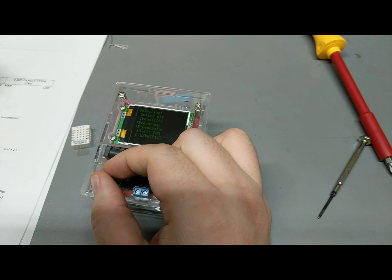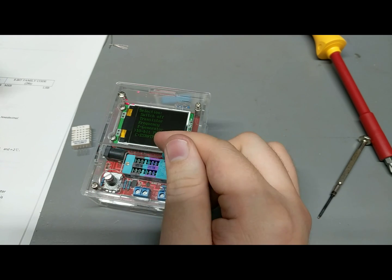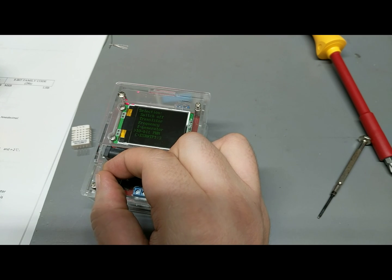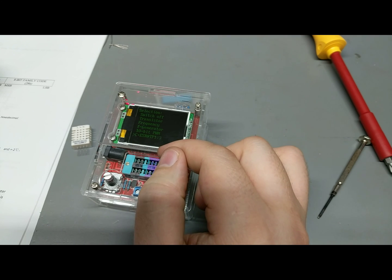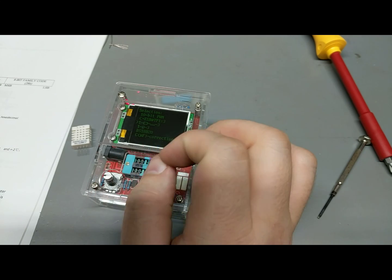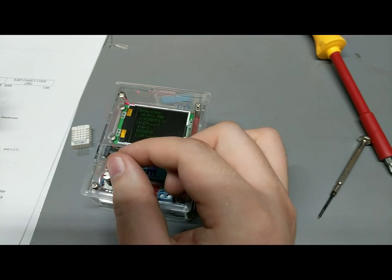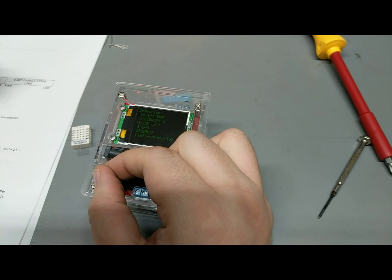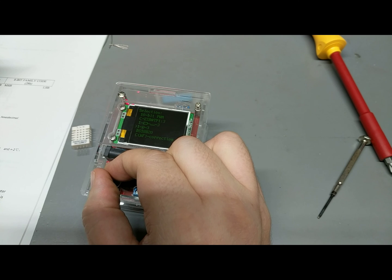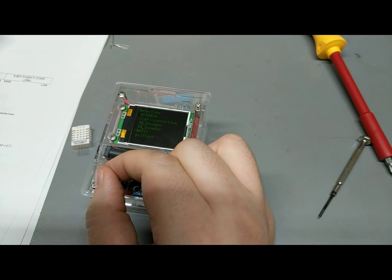Okay, yeah, because we haven't even got to this stuff yet, where you can actually do limited function generation with this. A 10-bit pulse width modulation. I'm not sure what you would be even testing with this. They have an explicit capacitor ESR meter, running from just test points 1 to 3. An inductor tester, so if you have maybe a very large, high resistance inductor that just confuses the auto tester, you can explicitly go in and say, this is an inductor, tell me what it is. Explicit capacitance tester, DS18B20, that must be the temperature sensor, I think, and capacitor with the microfarad correction. IR decoder, IR encoder, DHT11.